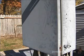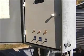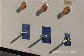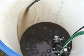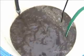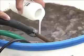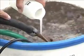We turned off the RAS pumps for a couple of hours to thicken the sludge in the clarifier to about three-quarters of a percent solids. When the drum is about two-thirds full, add 500 mils of the aged polymer mixture into the stream. Don't add it too fast. This helps mix everything.